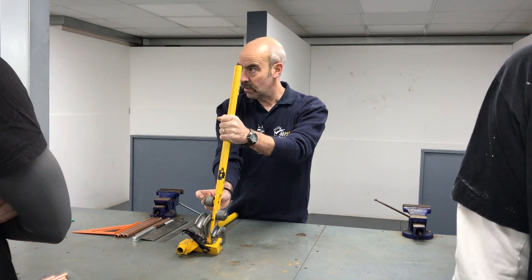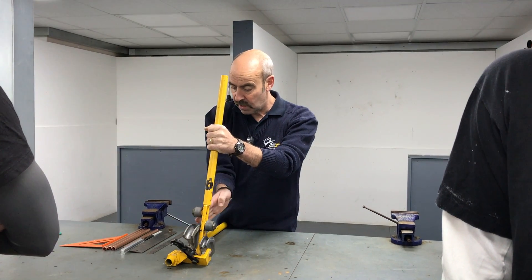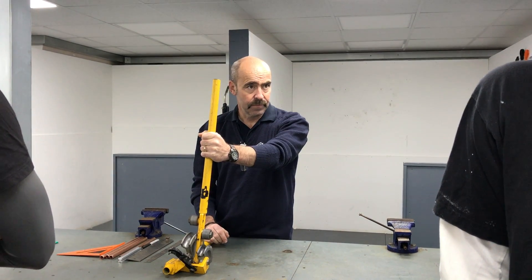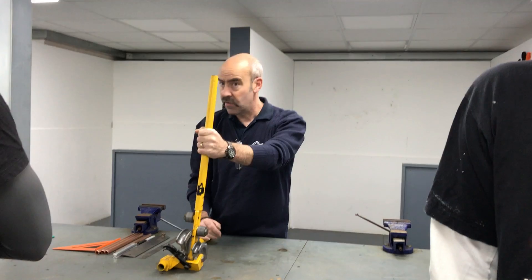If you don't check this nut and you're bending 22mm, this nut comes loose because it presses tight onto the guide, and as you roll, that will press onto the nut and slowly undo. If that bolt is sticking out and you put pressure on it, it bends it and now the pressure is pointing that way. The side of the former is not designed to take that pressure — it's going to shear off and you're going to wear it.